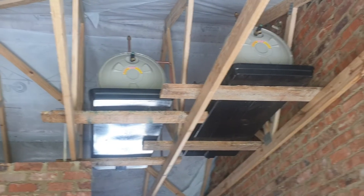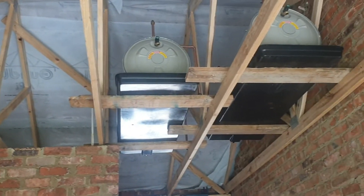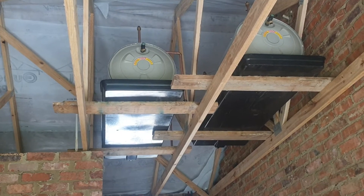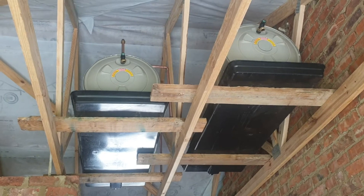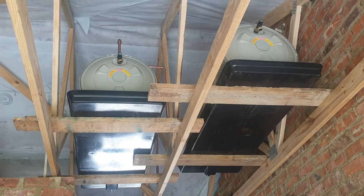You can see this is a very small roof. We only have five trusses here and they have installed two geysers that are being supported over three trusses. This is wrong, and over a long period of time these trusses will buckle under the weight of the geysers.